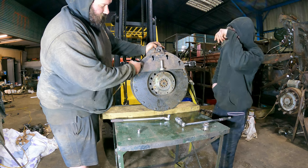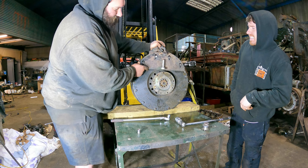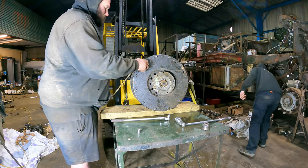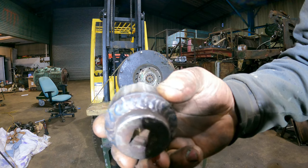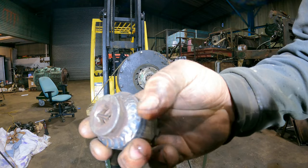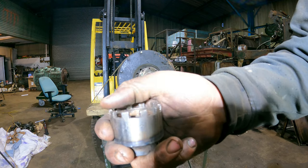It's quite clever — you can't take the bolts out, it's just on keyholes, so it slides on and then it pulls on. As with all these things, you'll see quite often as we rebuild and stuff, we have to make sockets and tools for the job. This one started life as a round piece of steel with the back end of a socket welded to it, and they've been milled into a custom socket.